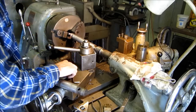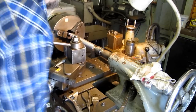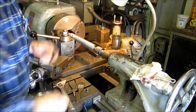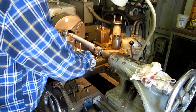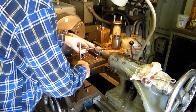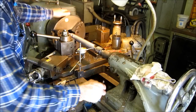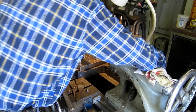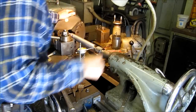So we're going to adjust the tailstock. And this is pretty nice because this is a full cut, so we can come over here. We give ourselves a little room here because we need to access our adjustments on the tailstock. So we're going to set up a mag base here, and we're going to put it right against our shaft here. I'm going to set this, and we want to bring the tailstock back this way, for, I think we moved it the other day, for the other way. We're a little bit longer out here, and there's our 4 there.